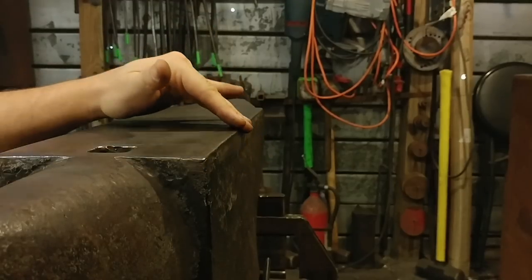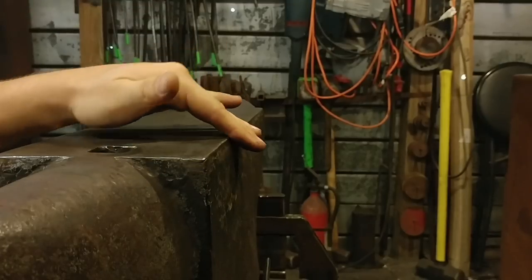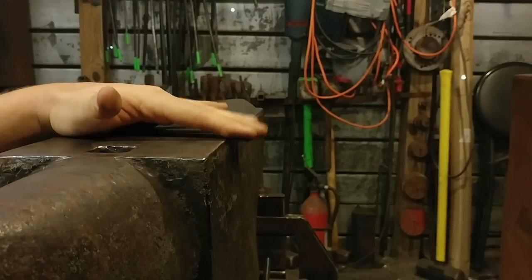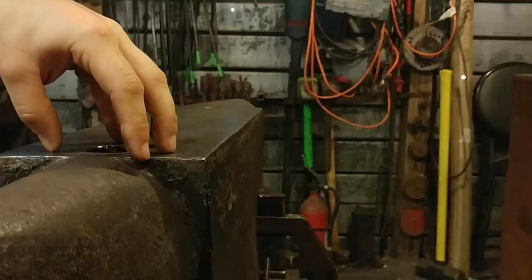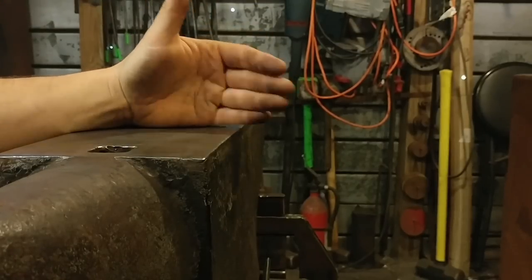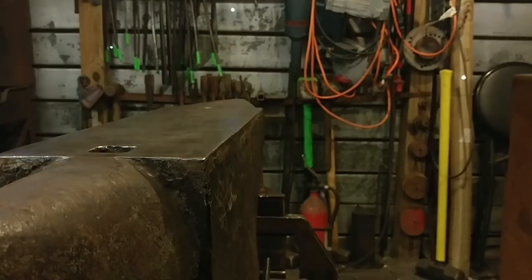When I say sharp edges, these are not razor sharp — you don't want it cutting or galling the material — but having really good edges on an anvil is very helpful. If you don't have that, get a block, and this will greatly improve your ability to make a pair of tongs. So that's a quick tip. Let's get to hammering.